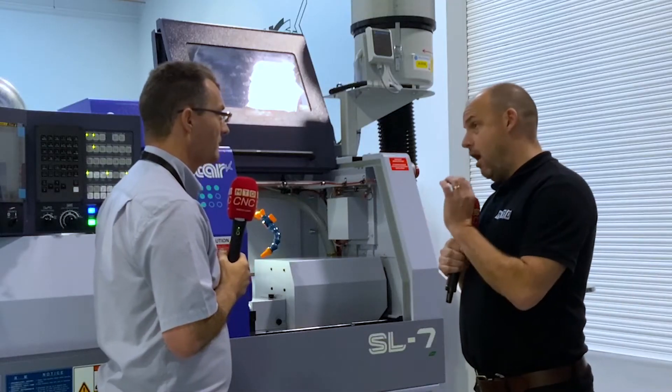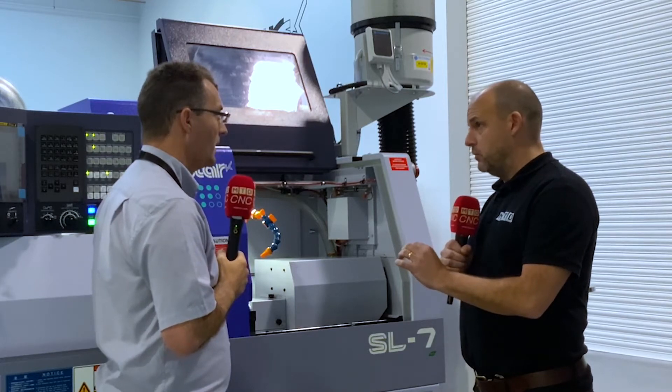Now what's the trick to machining very small diameters? What are the important factors that this machine addresses? It's stability, really, and obviously getting the attachments very close into the guide bush. This really is aimed at high volumes as well, in those areas? It's going to suit a lot of high volume parts, for sure. But even though it's a small machine - only 800 millimetres wide - customers have complemented the actual working area. It's quite big for a small machine. You can still get your hands in there and change the attachments very easily.